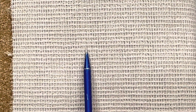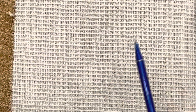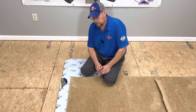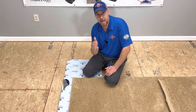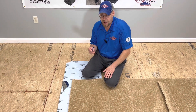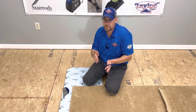If you flip the carpet over and look at the back of it, these big ribbed lines will always be running the width of the carpet. Once you get that figured out, it'll give you a better idea which way is the length. Carpet is made in rows — as you've probably seen on the back, you can see cords running across ways and also cords running lengthways. So carpet is made like a grid, and whenever you make your seam cut, you want to part those rows of fiber and run your cutter directly down in between them.